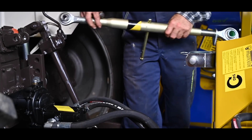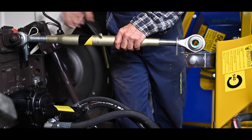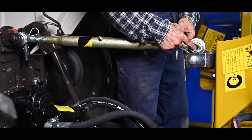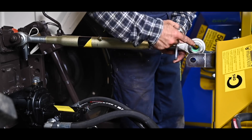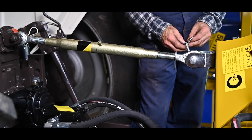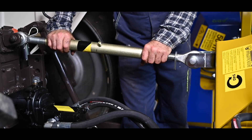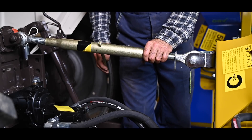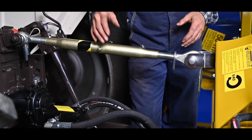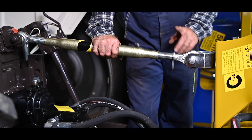Let's get this installed — the lifting arms are secured. Now that we have the Trimmy at the right height, I'm going to refit the oil pump. The next thing is to install the third point — this is an adjustable bar so you can correct the angle while lifting the trimmer. It doesn't come with the trimmer so this is a separate piece. I've put a little nylon bush inside because this is a CAT-2 opening and this is CAT-1, to avoid play. And with this you can adjust the position while the arms are lifting the Trimmy.